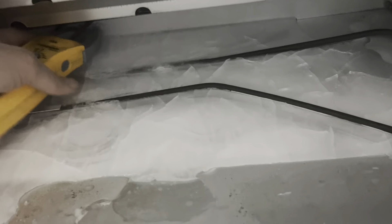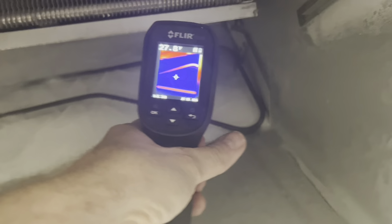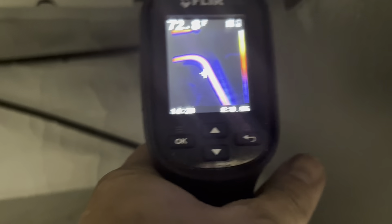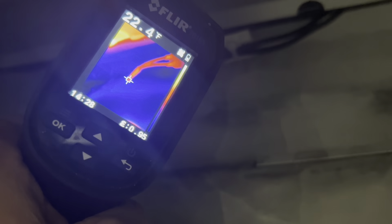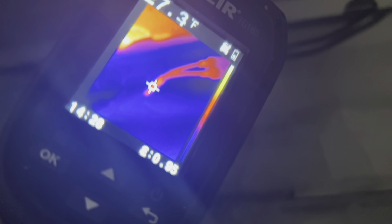Sometimes these are really funny. You have to watch because sometimes with thermal cameras it's just a matter of contrast. You can see my heater is surrounded by ice, so it's glowing red and it's 80 degrees. But up here, there's my drain line heater — and you can see it also looks like it's glowing red, but it's actually 27 degrees because what's around it is pure ice.